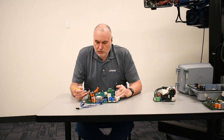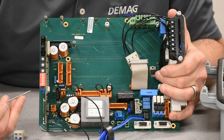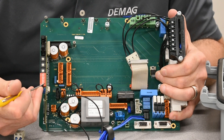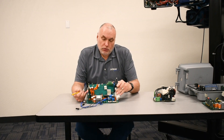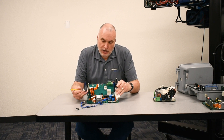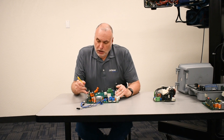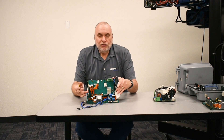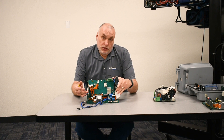In a hoist, typically only the number 1 switch will be turned on when the control board is located in hoist number 2. For hoist number 1, the number 1 DIP switch is turned off, and most of the time all the switches will be turned off in the hoist. Sometimes, very rarely, number 4 will be on — number 4 is for abrupt braking of the trolley function. If you see it turned on on the old board, consider turning it on for the new board.